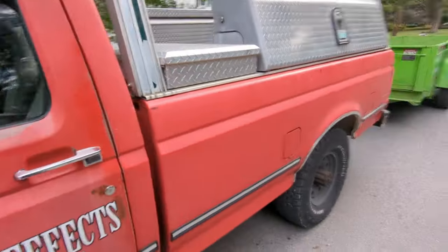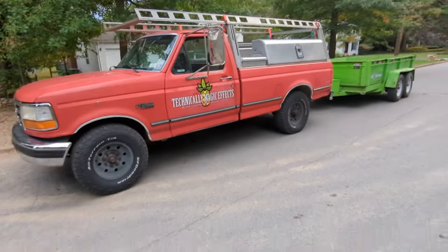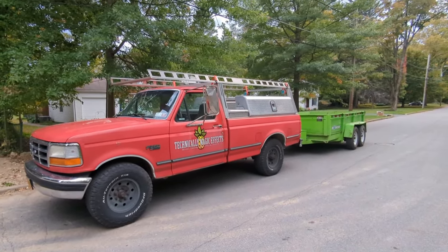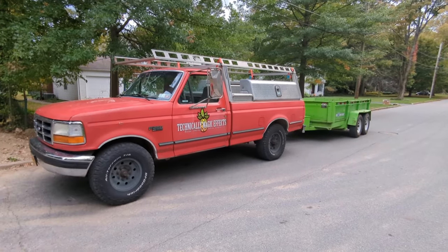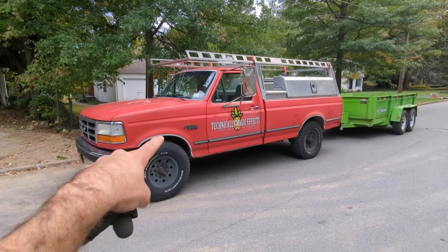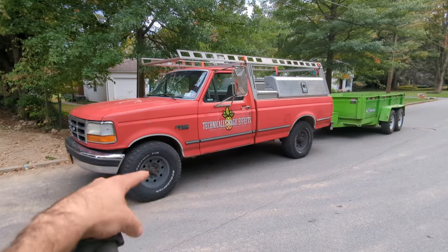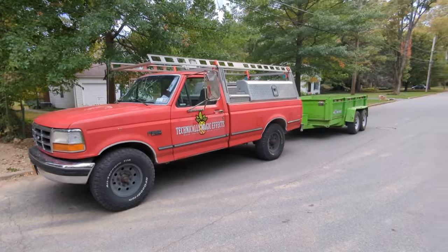We'll have to see. And I think we're going to go up 3 inches with a lift kit. Seems silly, but the truck's got 30-year-old suspension. It's a two-wheel drive truck, but that four-wheel drive ride height just looks so much better. And I rolled up next to my buddy, who has the same truck with four-wheel drive, and there's just another 3 inches of wheel gap. My truck's about a hair under 20 inches from the wheel arch to the center line of the axles, and the four-wheel drive truck is a hair under 23 inches. So essentially, I did the math.